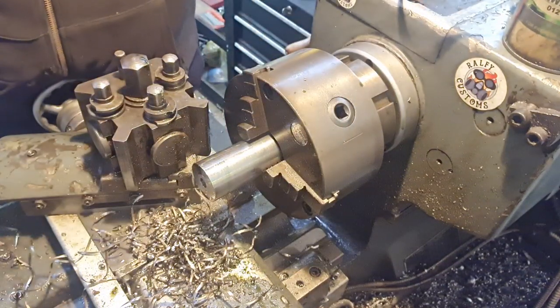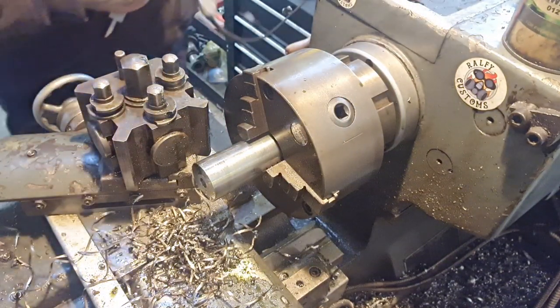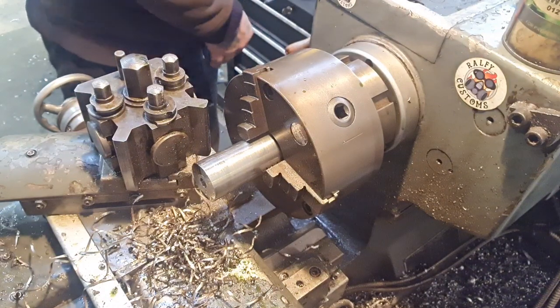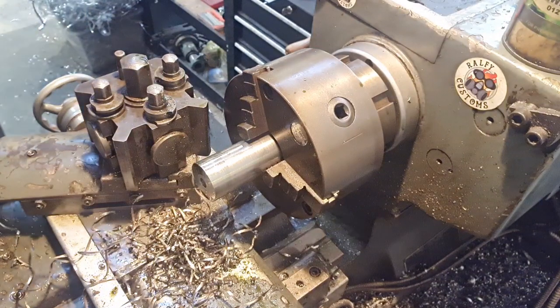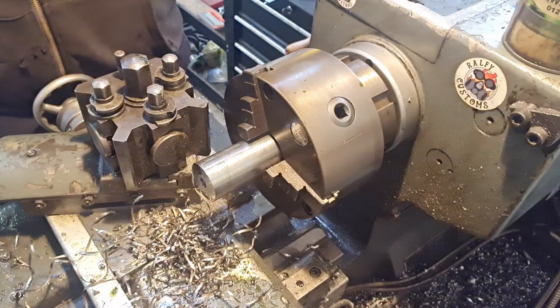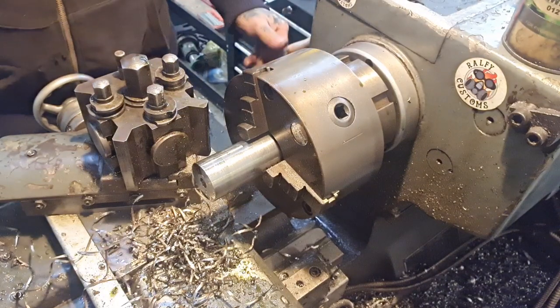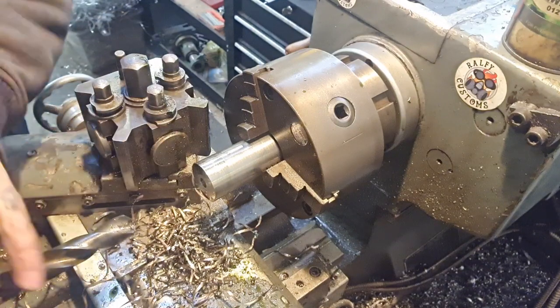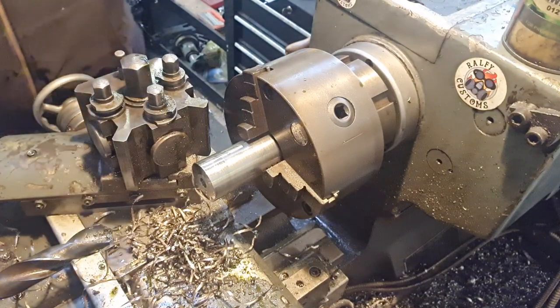I'm going to go with drill it undersized and bore it out. I think that's a sensible way to go. That's what we're gonna do. We're gonna go in now and slow things down quite a lot. Just realised I put my oil bushing upside down. And we're gonna go in with a 22mm bit, leaving us 3mm to come out.